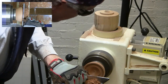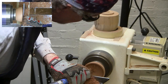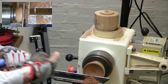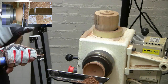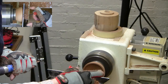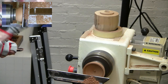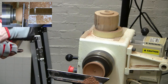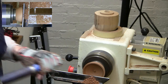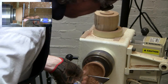Now, you also have to keep in mind when we're hollowing the sphere that we still have to cut that groove all the way around in the opposite direction. So we don't want to make this the thinnest wall box that you've ever made. We want to allow for in case we have to cut a little bit. Now, the dead center should be the diameter we want the sphere to be. So when I cut that other groove in there, it really shouldn't be cutting very deep right at dead center. But I always like to have a little bit of thickness there.